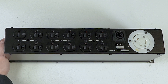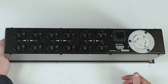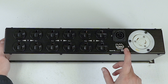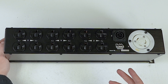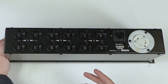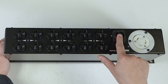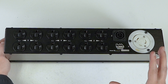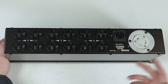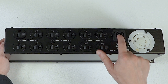On a lot of distros, we're kind of configuring systems per gig or per job. Sometimes just being able to plug a bunch of stuff in is great. I do like putting a TrueOne or a PowerCon — or both — on many things. The reason is we make a fourplex PowerCon and TrueOne breakout cable from one foot to a hundred feet, which is a really good way to provide additional courtesy outlets. If you want the LM Tour Systems fourplex breakout, check the link below. You can also buy these direct — check the link below for our web store.